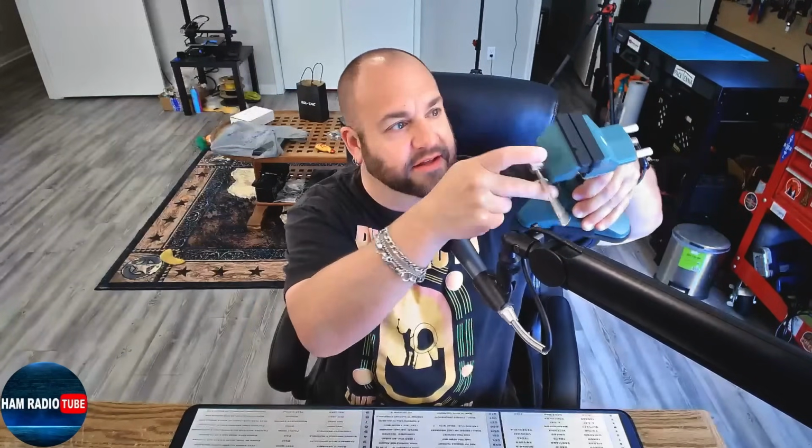Thank you so much. Another thing to mention, make sure your soldering iron is good and hot. I set mine at 700 degrees, and that pretty much does everything for me. And never underestimate the power of a good vise. If you don't have any dexterity in one of your hands, use one of these. This is just a cheap vise from my favorite hardware store, Harbor Freight. It's got some rubber on it, so it doesn't hurt anything that I put in it. And you can set this on the counter. Use this to hold the coax and do whatever you got to do. So hopefully that helps. Thanks so much for writing in, and good luck with your PL259 connectors.